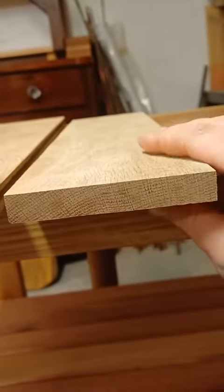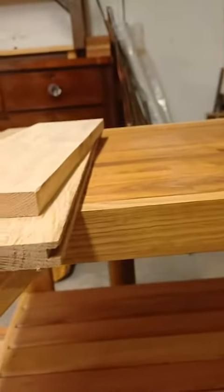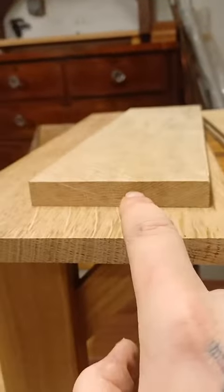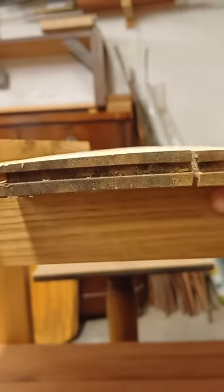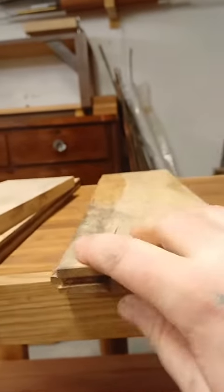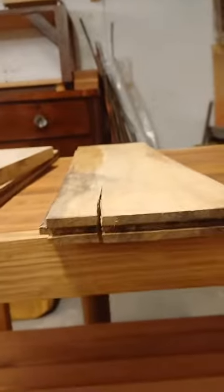This is something I machined up recently, so I know it's perfectly flat. But we also have a piece of flooring here which is also plain-sawn — same as this piece. What happened is this was slightly damp when I got it, and as it acclimatized and dried out, you can see how it's not flat at all. There's a lot of movement in that.